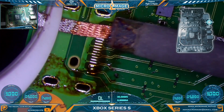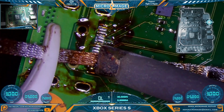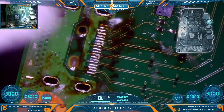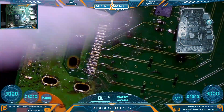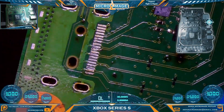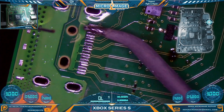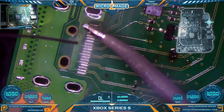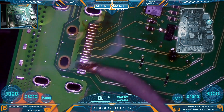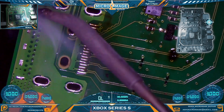You just have to sit on there until it comes out. Gently going to go with the pads here — we have to do it because we used a low melt. Low melt does ensure we don't tear pads. Clean gently — we don't want to knock any of these little small parts, so don't scrub hard, just scrub as much as needed, which is not much, especially on a preheater. We're going to put some solder on our tip and just rub the solder ideally over the pads where more solder is needed. Not really trying to make contact with the pads — you'll make incidental contact though. These you'll have to rub in a little bit.